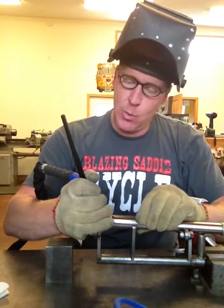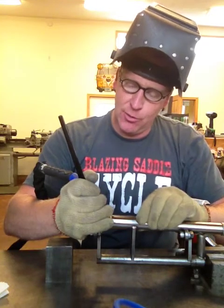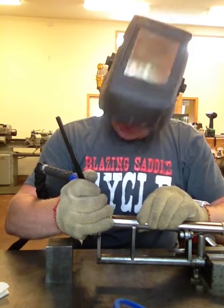Pausing at the end of each run to make sure that my metal cools underneath the external flow of gas before I move on. As I continue to weld around, I have residual heat buildup, so it takes a little longer for each one to fall below that critical temperature.